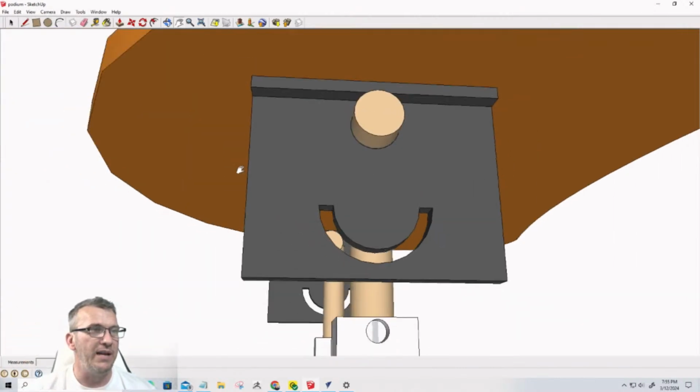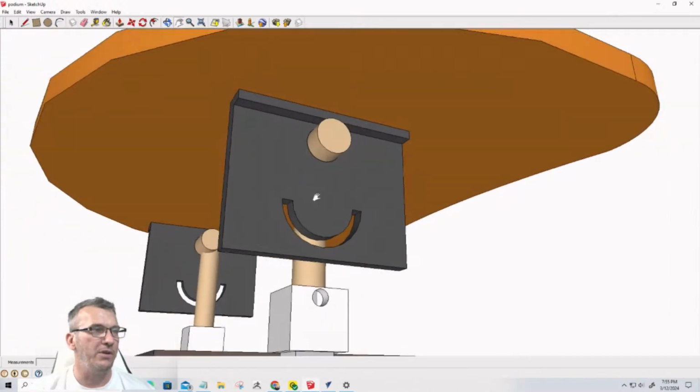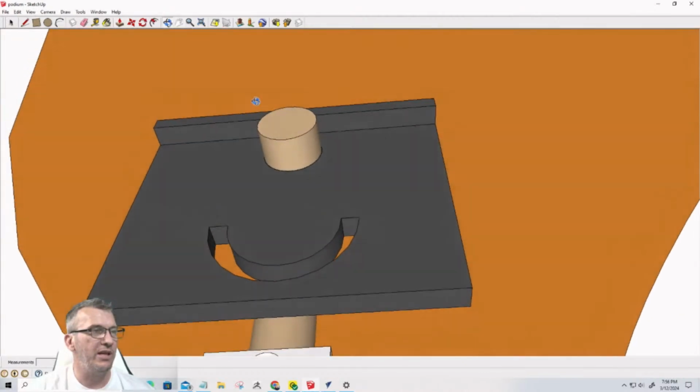This can easily be made out of wood, but yes, with a CNC, Brooks Martin, you absolutely could. It just depends on the rigidity and the power of your machine. Even the 2440 could do it. I've cut aluminum parts on it before. You just got to take it slow and easy. It's a dry cut, there's no lubricating, so you've just got to take shallow passes.